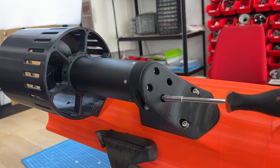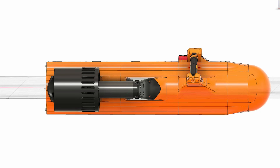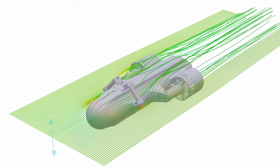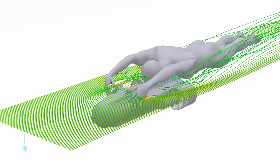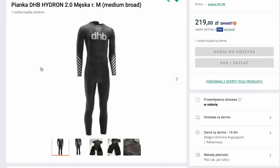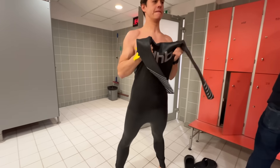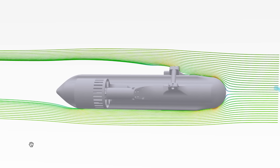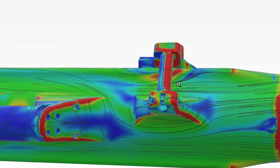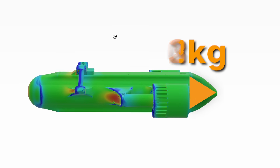After 3D printing this structure, it honestly appears quite bulky. That's why we also designed big domes for the front and the back — they make it a lot more hydrodynamic. It's not only the hydrodynamics of the vehicle that are important; it's the entire human-and-vehicle system which we need to optimize. That's why we also bought a triathlon wetsuit, which is a bit more hydrodynamic than a normal one because of the smooth surface. We know this scooter and jetpack could probably be much more hydrodynamic, but a simpler design will be much better to start with, and we believe in our very large thrust.